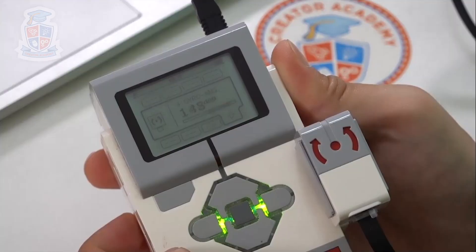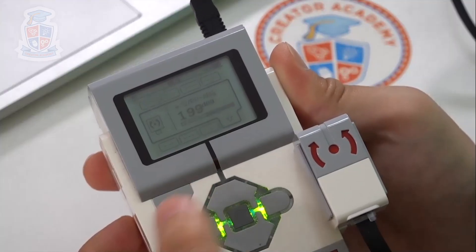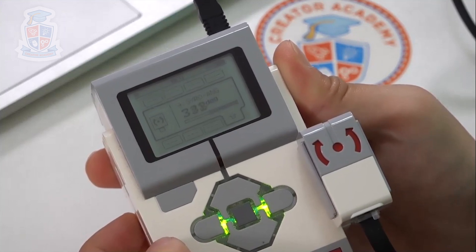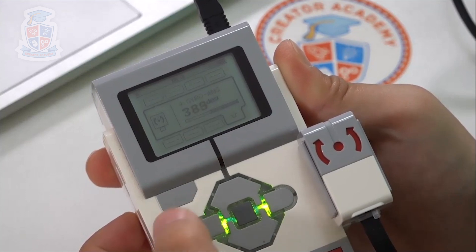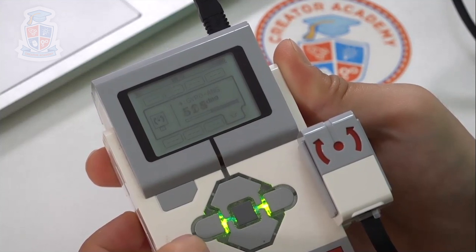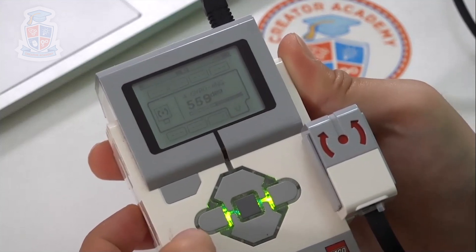So I'm going to induce a gyro drift on this robot and show you what it's like. Now I'm going to turn it on again, but this time I'm going to be shaking my robot around while it's turning on. I switched it on. Now let's have a look at the port view again — you see that? The gyro reading is moving up even though I'm keeping relatively still with the robot. It looks like it thinks that I've rotated 360 degrees or more, which is obviously not the case.